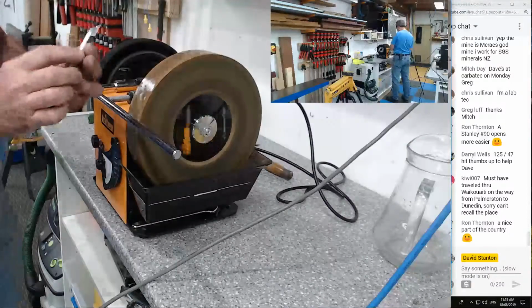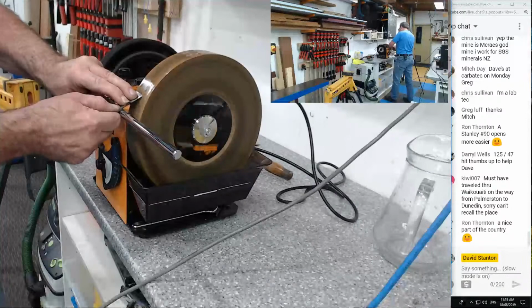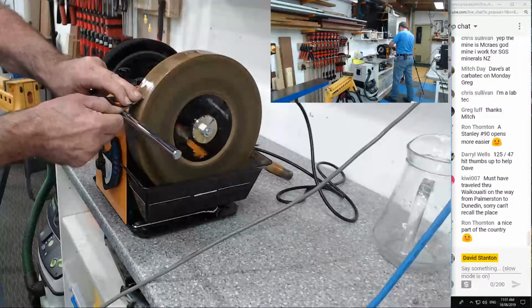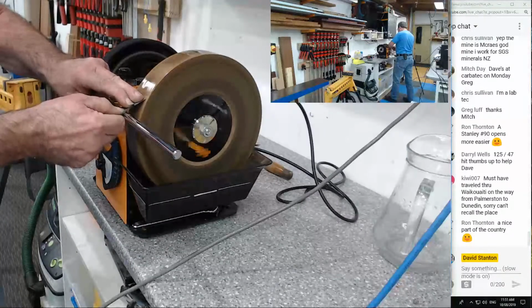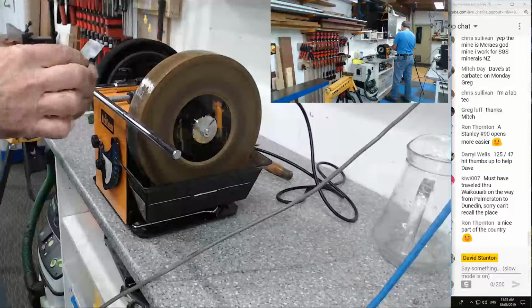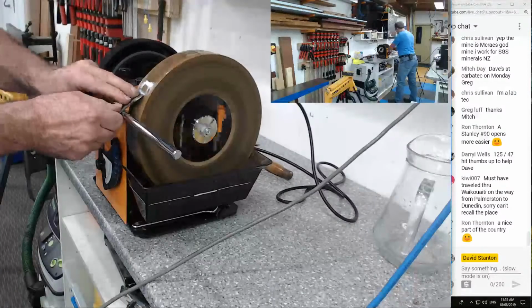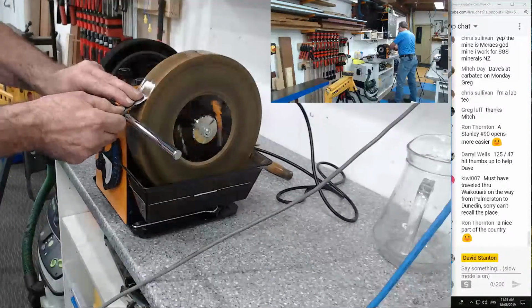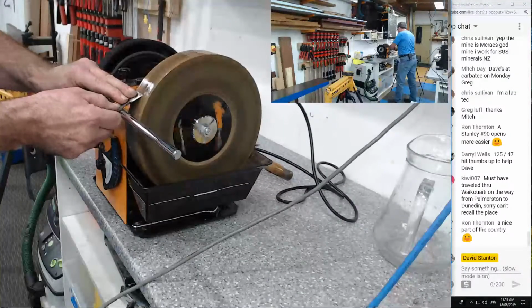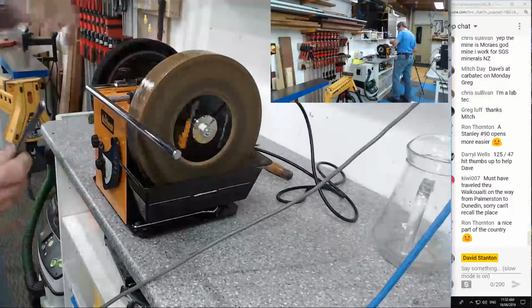Now these blades are important to get as accurate as possible. He says while he's doing this freehand. Because there's only a certain amount of play that I can adjust it with when I put it back in the plane body. That's why these have a skinny shank here, so that you can move them backwards and forwards so that the bottom is perfect. Okay, nearly. I can feel it. When you're doing it freehand like this, you can feel the grind. That's done. All right, turn her off.